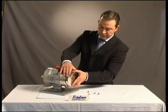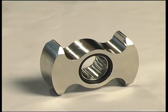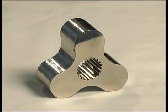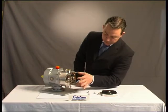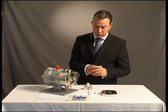As you can see as I remove the front cover, we use a bi-wing rotary lobe, as opposed to some of our competition who use a tri-lobe rotor. Some of the benefits of a bi-wing rotor design is, as you can see, there's only four points of agitation within the pump head. With a tri-lobe you're looking at six points of agitation, which actually damages and manipulates the product much more.